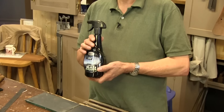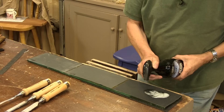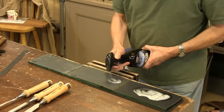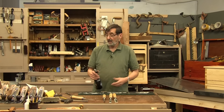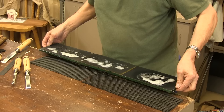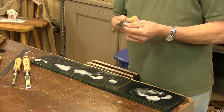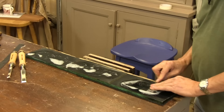I'm using glass cleaner — this is the most inexpensive lapping fluid I've come across. I like it; it has a pleasant smell and it's not an oil-based product. Water will do exactly the same — I haven't found much difference between any of these fluids, and I certainly have not found that actual lapping fluid works more effectively. I've also got some shelf liner here — that silicone non-slip stuff. Plop it on there and that gives it a fairly rigid hold. I'm going to take the back face of the chisel and offer it to this abrasive paper.